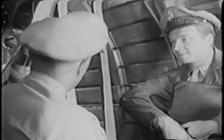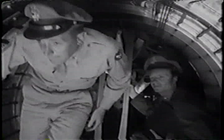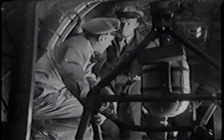We'll start with a tail oleo. Is she like the others? Not quite. This baby should show about 2.5 inches of shiny cylinder. I see. Notice the equipment stored in this section. Look for anything loose. Everything should be anchored down so that it can't move around, even in rough air. That goes for the ball turret, too, before takeoff.